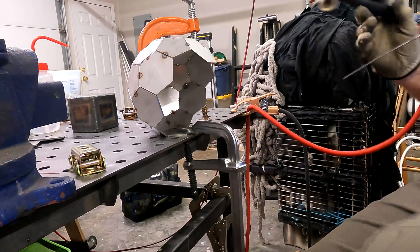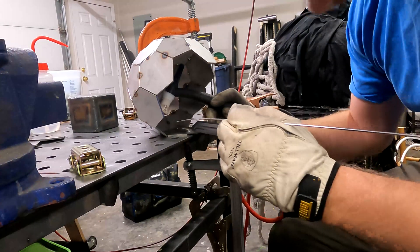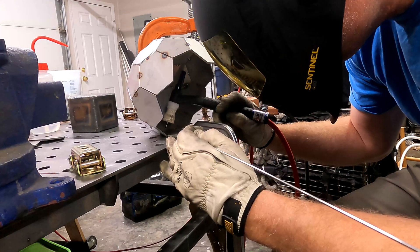I do think if you're just starting out with stainless steel TIG welding, this kit is a great option. It's a great way to learn a bunch of different skills all at once and have some fun doing it. It has enough pieces and difficulty that it'll take a good couple of hours of welding, fitting, and problem-solving — it's not just a five-minute thing. All of that gets you figuring out how to hold pieces together, how to hold the torch at different angles, and how to shorten the torch to fit into a tiny concave area for a tack weld — things I hadn't had to do before. That said, if you've never TIG welded, you should definitely practice on flat plate before spending money on kits like this.